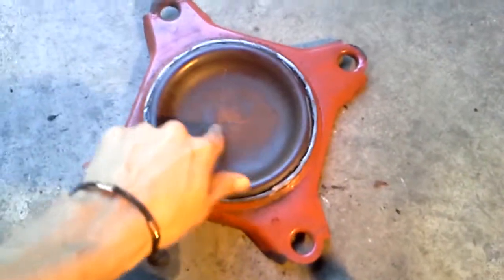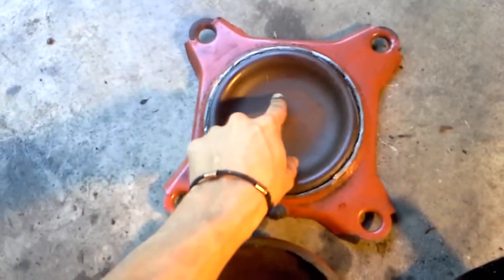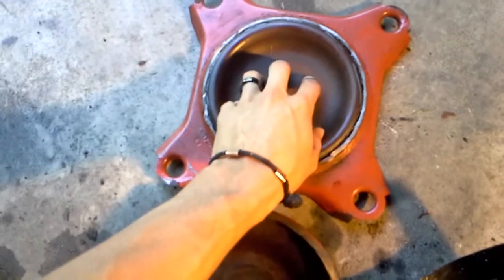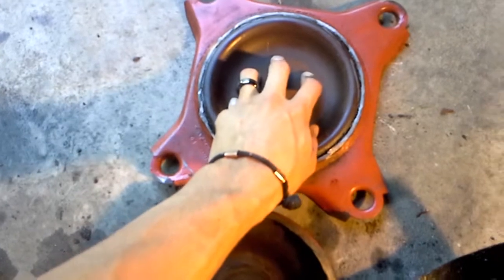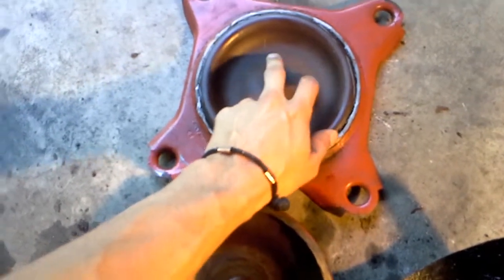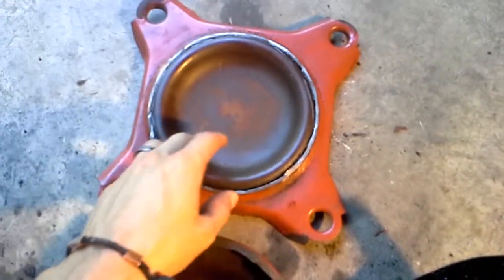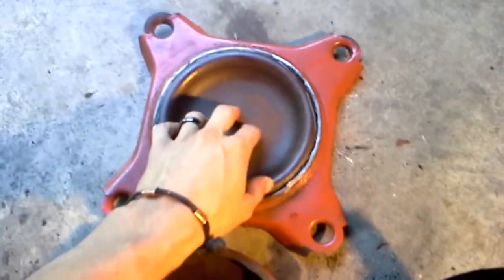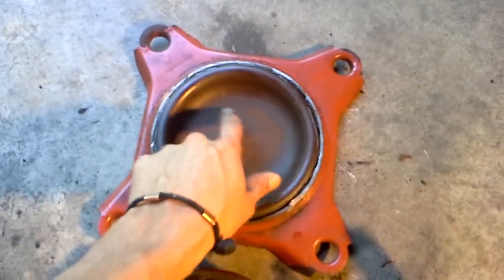The base has a dish to it for the oil to sit down in. On the Trane rotor locks there is actually a magnet in the base to pick up any machining dust or small metal fragments from operation — they get caught on that magnet. I didn't see any magnet inside this scroll, so scrolls must not have that, but every Trane reciprocating unit I've taken apart has had a little magnet in the base.